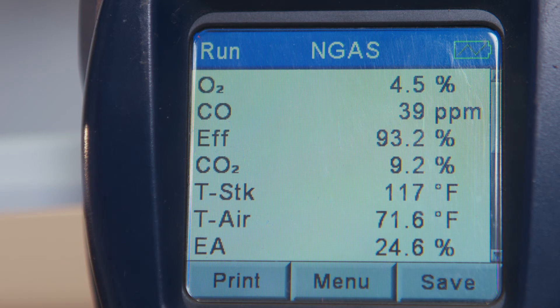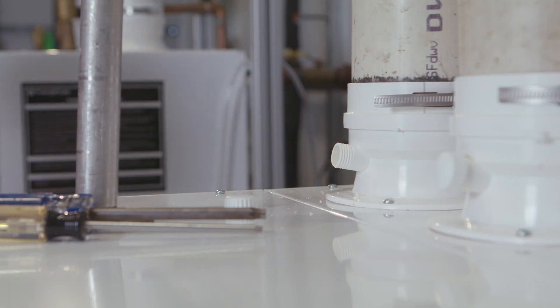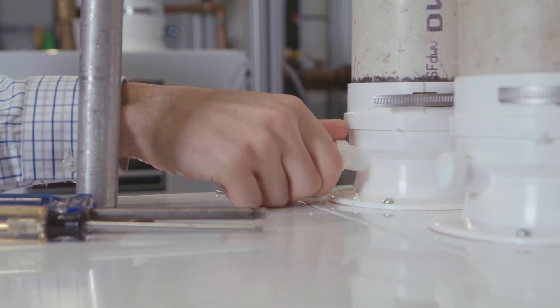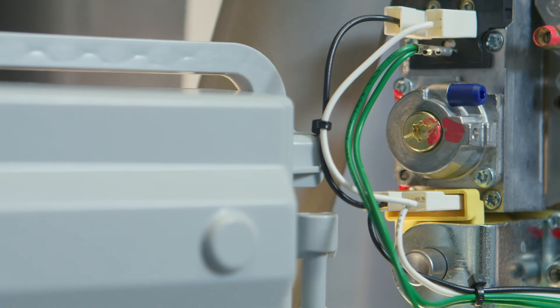So we're all done. What we need to do is turn the fan off — just press OK. It'll say released, and that's how we know that test mode is off. Take out our test probe and reattach the vent test cover. Reinstall the offset screw cap, then put the cover back on the boiler and return it back to normal service.